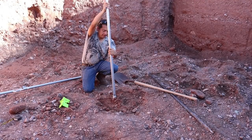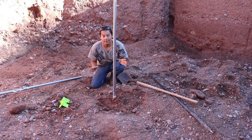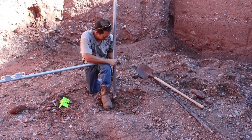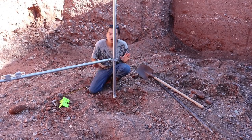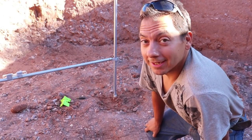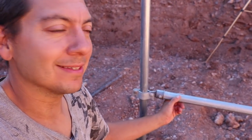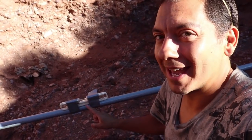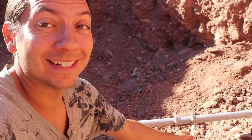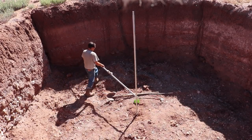Looking mighty nice. Our root cellar is going to be a 14-foot interior diameter and eight feet tall. I've got my pole arm here — I'm going to attach that and then we should be good. This is looking really good. I'll also leave a link to a video we did on installing this, but let me show you some improvements and lessons learned. The pole arm kept sliding out of the socket, so I put in a little screw — that keeps the arm in place, a huge help. We also taped a small level to this arm, which was a game changer for earthbag building. And on your pole arm, you want a little L-bracket to measure the inner diameter of the bags. Now I can freely maneuver the arm all the way around.